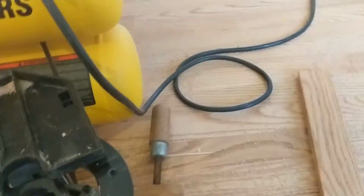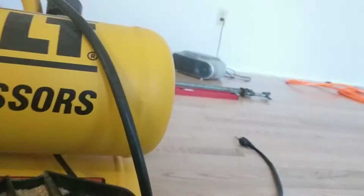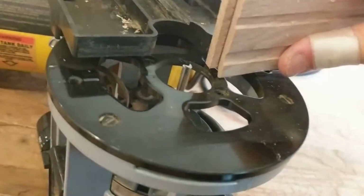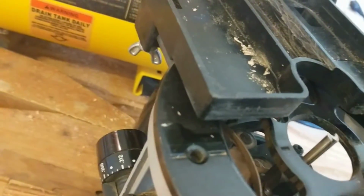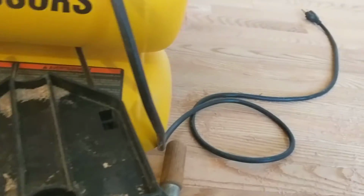Okay, then what I can do is set the height. First I got a 1/4 inch bit, just because the channel is a 1/4 inch. I happened to luck out that it's a standard size. Then you can adjust the fence and the depth on this cutter so that it is slightly deeper than the existing channel, so that when you route a new channel, it's going to be deep enough. And it's only exactly the size of the previous one, a 1/4 inch. So it should still produce a tight fit as long as you get that channel in the right place.